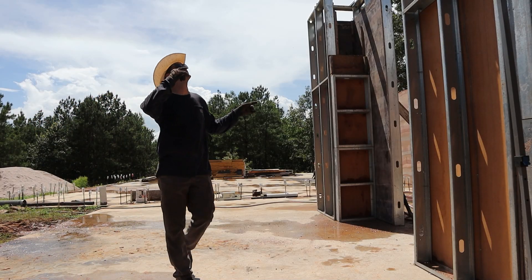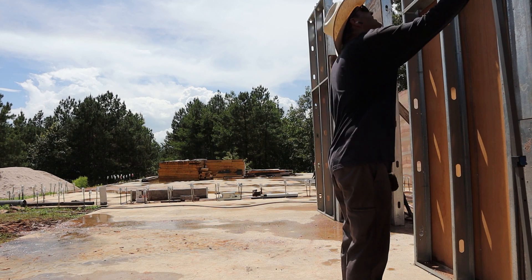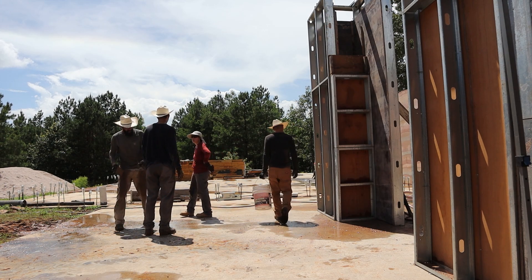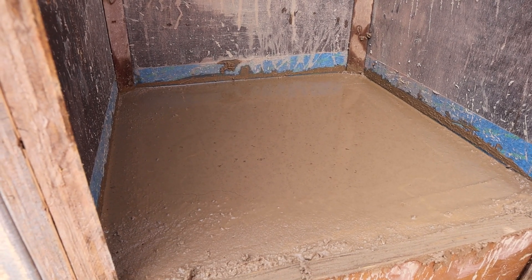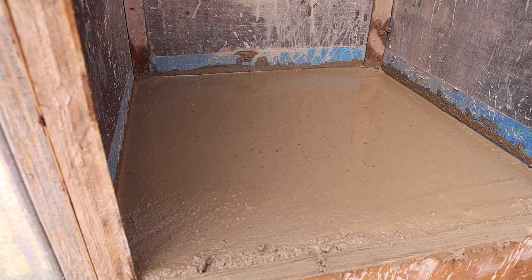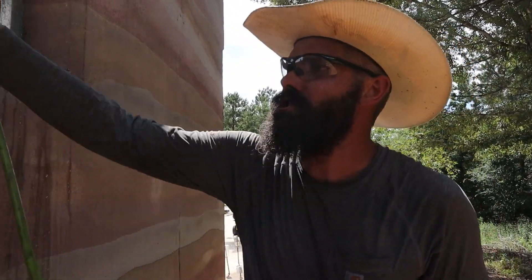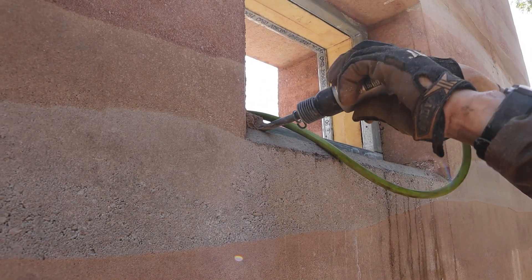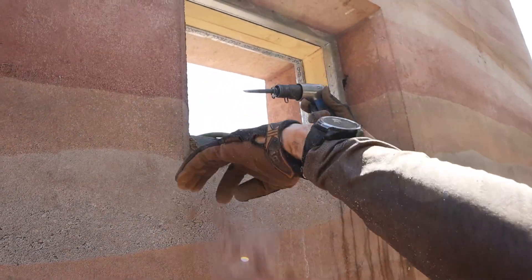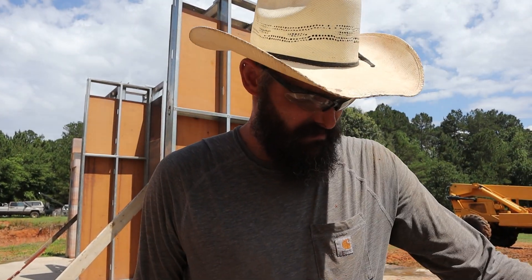Do you want to use any of that in the windowsill in the shower? Yeah, maybe — fill up a five-gallon bucket, I don't think it'll take more than that. So here's the top of our pillars — concrete it in, all done. We're clearing the rammed earth that pushed under our forms a little bit. We're going to clear it out with an air hammer and then cement concrete in all this. That stuff's really hard once it cures — which is a good thing.